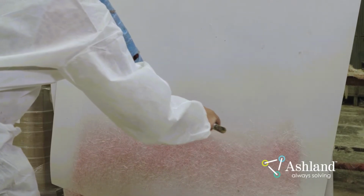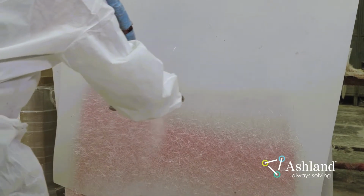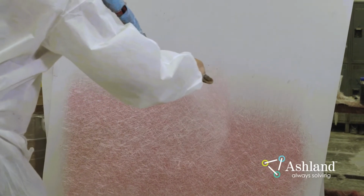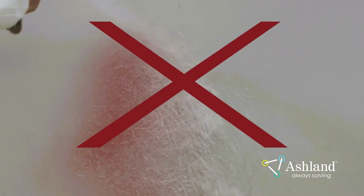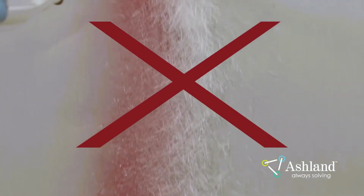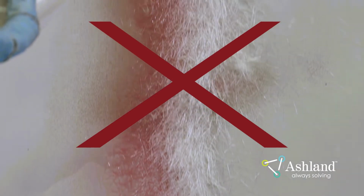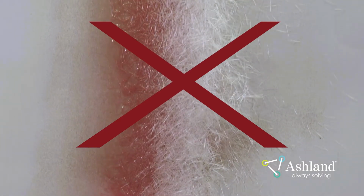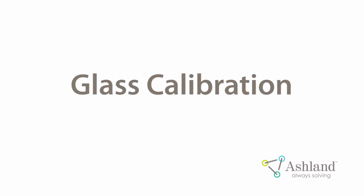Start with low pressure and incrementally adjust the pump pressure up to the lowest possible pressure that will support an even pattern. Position the chopper motor to evenly distribute the glass into the resin stream. The glass usually intersects with the resin approximately 15 to 20 centimeters from the sprayer tip. Adjust from side to side to ensure the glass is hitting and dispensing the pattern evenly. From here, adjust the cutter head speed to obtain proper glass-to-resin ratios. Use a disposable surface, like booth paper or cardboard, to observe and adjust the glass and resin distribution prior to spraying the part.